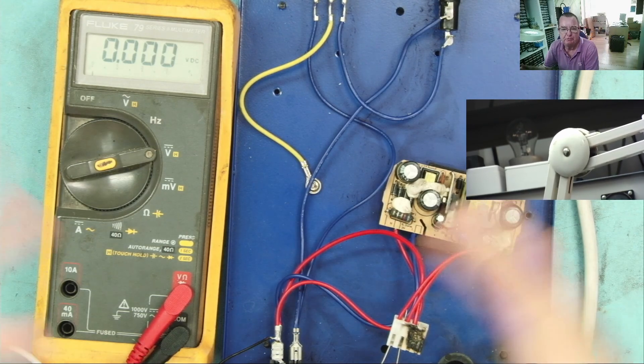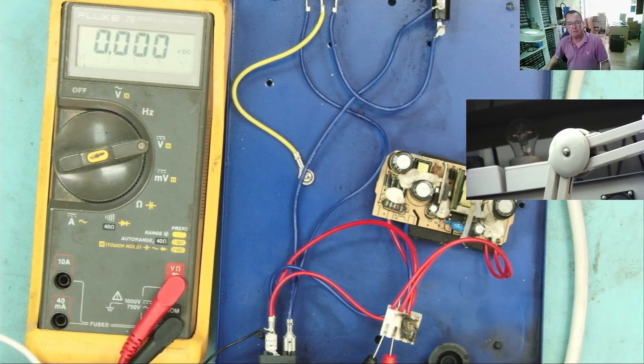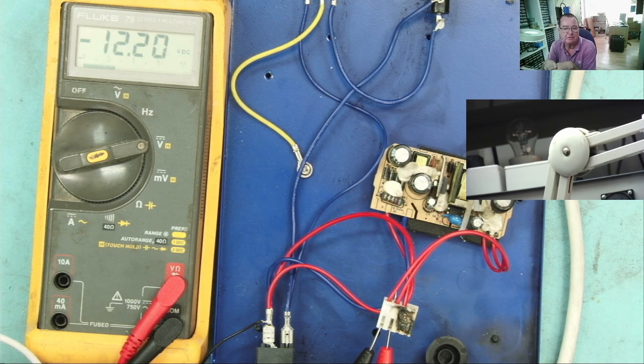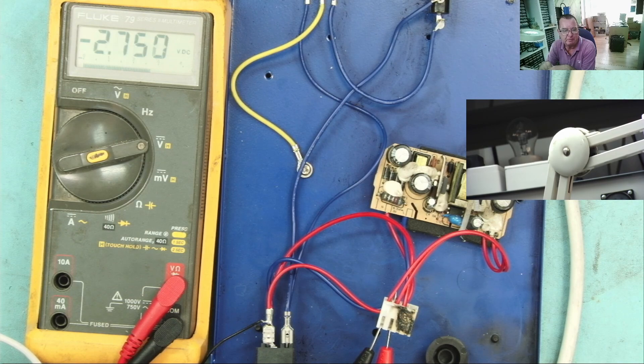Handy Andy said this was tripping out the mains, so I've connected it to my current limiting light bulb, and I'll make sure it's on limit. If there is a short, the worst that should happen is the light bulb will come on. Switch on and power up - well we have 12 volts. I have the polarity the wrong way around but it doesn't matter. So it's not blowing fuses - the power supply is working. I'll give that a couple of minutes for capacitors to discharge before I start handling high voltage areas.